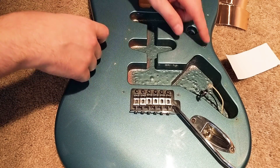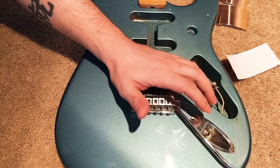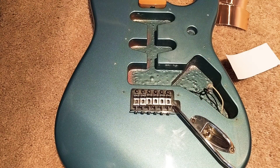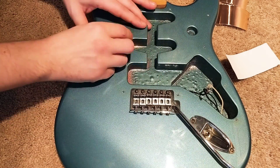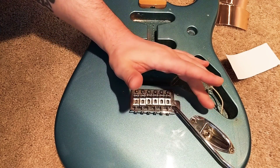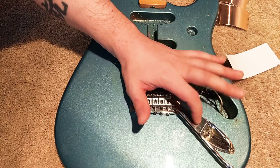If you're seeing extra holes, it's because I drilled them from various pickguards. I'm not going to shield the input jack, because every time I do, if that cable hits when you're plugged in it's going to ground out and shut down your whole pickup — you don't want that happening in the middle of a show. I don't want my guitar acting like a bypass switch. You could route it out bigger so that doesn't happen, but I don't want to do that.